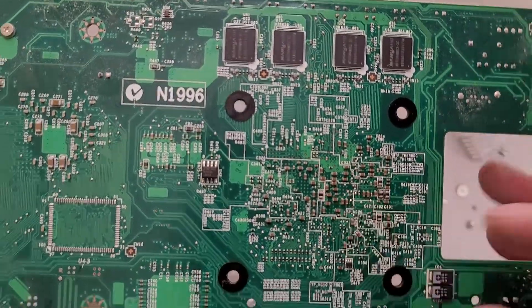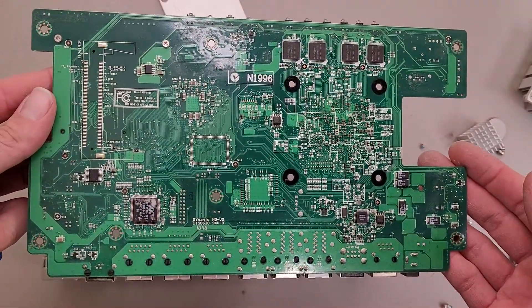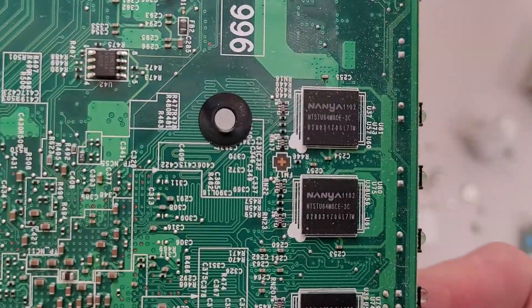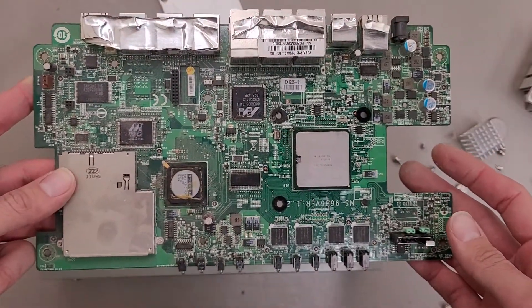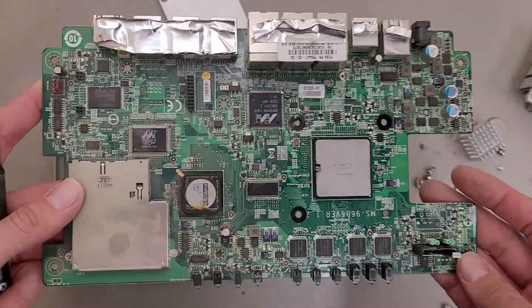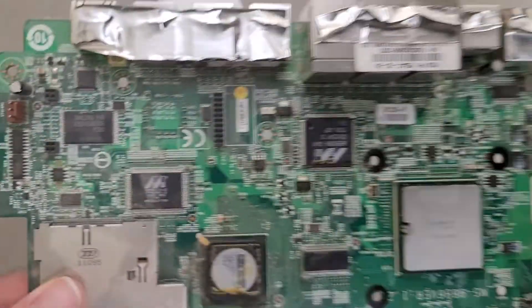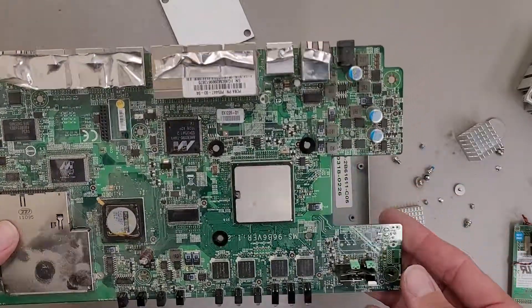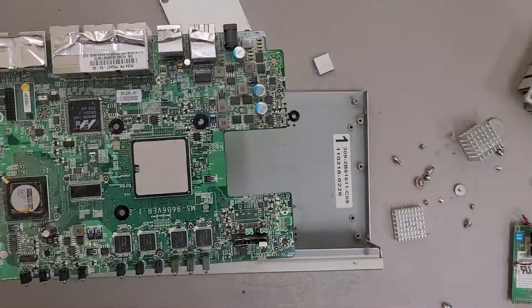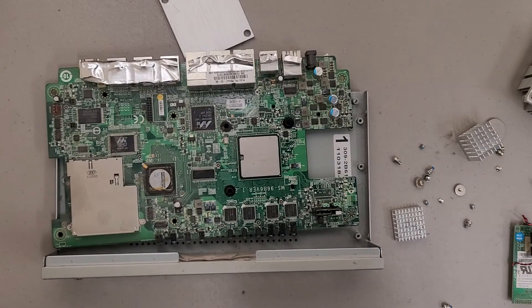Just some memory and then a bunch of traces under the CPU. I couldn't tell you how much RAM this had — I wouldn't be surprised if it had a gig of RAM. It's probably DDR2 based on the shape of the chips and the age of this unit. I'm guessing this Samsung chip must be the boot flash, because this doesn't have a spot for a CF card. Hopefully that's interesting — thanks for watching.